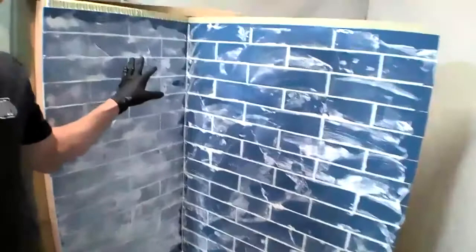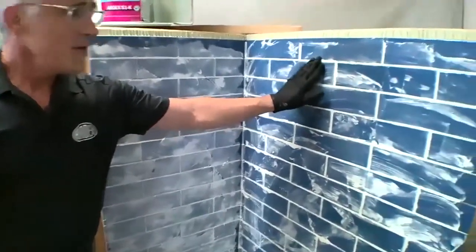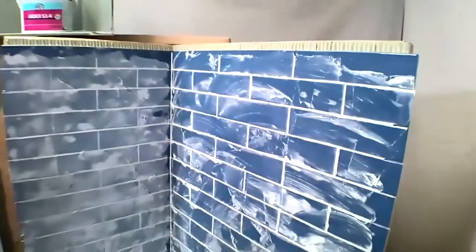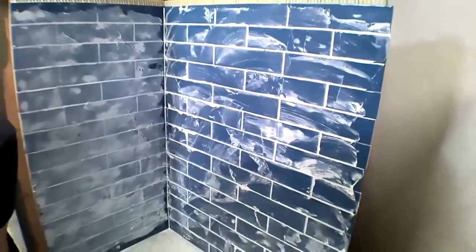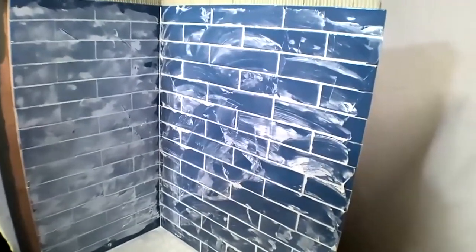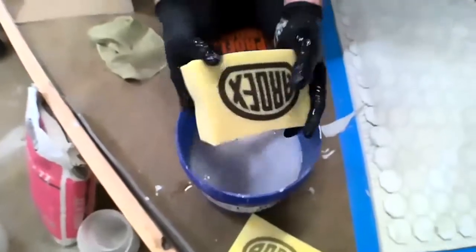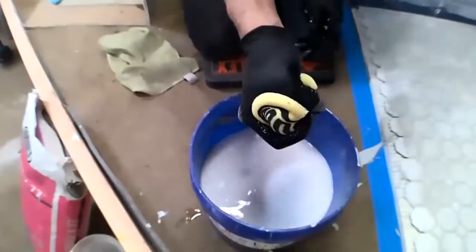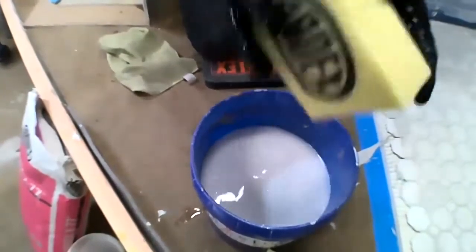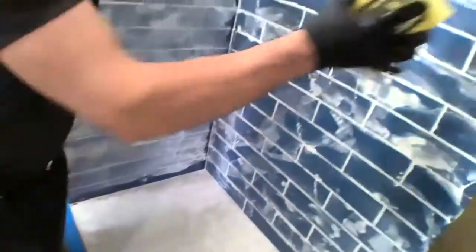So we're a little early here on our WA epoxy grout, but I tell you what, I am going to get started on cleaning up my FGC. Got those guys. So one thing I want to point out, Aaron, if you can just shine down here for a second. So my grout sponge. So notice how well I'm bringing that out. So we're damp. We're only damp with our sponge. We don't want our sponge with a lot of water in it.